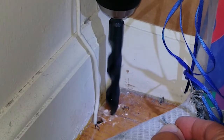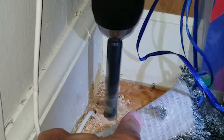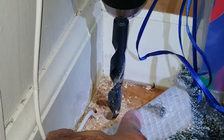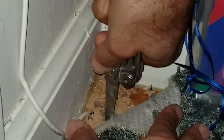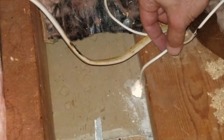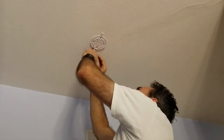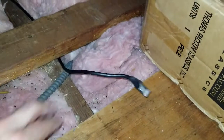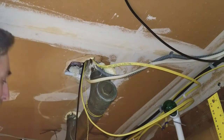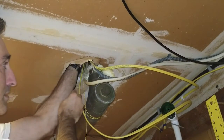I used the drill to get most of the way through the floor before hitting a sill plate, so I moved over a little bit. Once the hole was through, I used a small saw to square it up to accept the RJ45 connector. Once that hole was large enough, I moved to the attic and enlarged the hole in the sheetrock. Once the holes were prepped and fit-tested with an extra ethernet cable I had lying around, I disconnected the cable from the POE injector and removed the access point. I then fed the cable back through the hole and backtracked it to the area of the pipe in the attic. As I gently pulled the cable back into the garage, I ran into resistance — this turned out to be the cable getting hung up on one of the Romex cables at the point they exited the wall cavity.